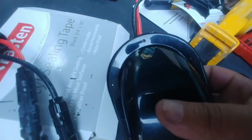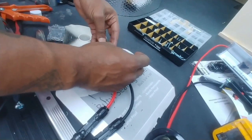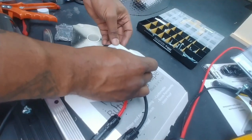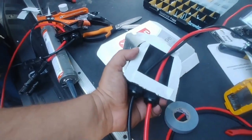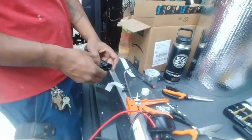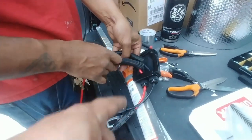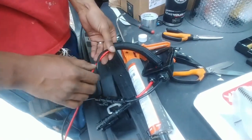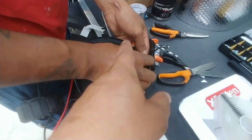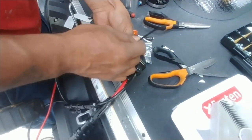If you want to be extra thorough, add one screw hole in the front as well. Go ahead and put the butyl tape on the bottom of the entry boxes down here on the ground — that way you don't have to do it on top of the car. Leave the backing film on so when you get up there you'll have a super fresh install. We're also running an extra cable entry just in case we need power up there in the future. To protect the wires, we're putting them in Alex-Tech braided sleeving — it's easy to install and prevents abrasion against the vehicle body.